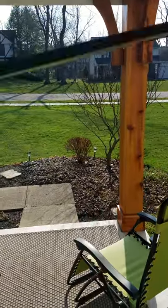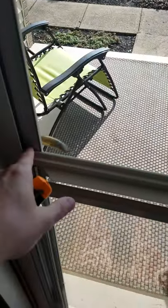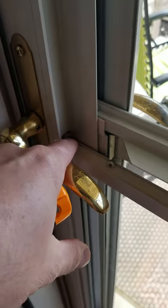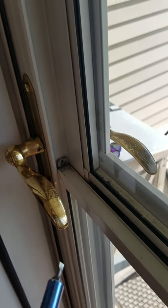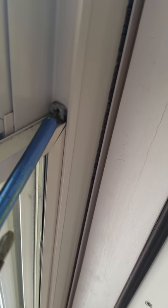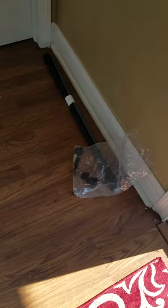The seal rips across the bottom right here and the screen just goes right up into the thing. You start off by undoing these two screws on the end right here on your bottom sash. Next it says you're supposed to slide these clips out after you take the screws out. I've got the new screen that comes with all new hardware, plastic clips and stuff.